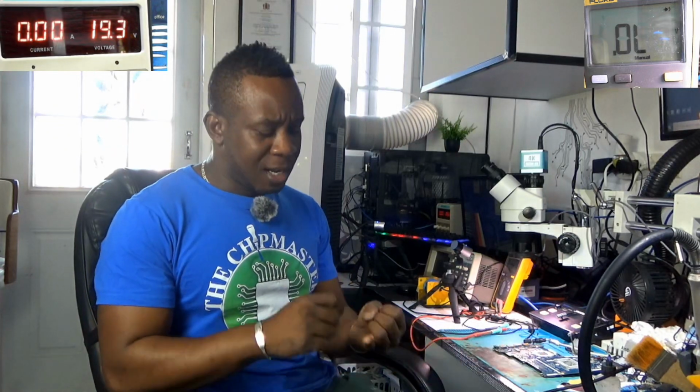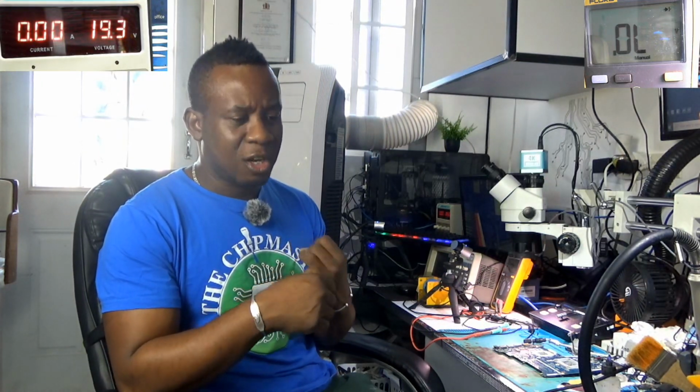A linear voltage only provides roughly 300 milliamps of current, while a PWM circuit for the 5 volt and 3 volt standby section can output up to 7 amperes of current. So normally when this chip gets hot on the PWM standby area, the RTC section is shorted, which is most likely a dead short cap, or it can be a dead CPU that is shorted in the RTC section. Secondly is the embedded controller that is shorted. The embedded controller normally wants 3.3 volts linear voltage with about 100 milliamps of current in order to produce the standby voltage for the embedded controller.